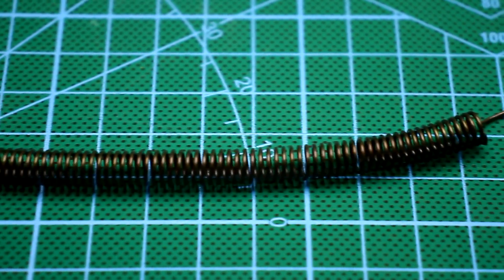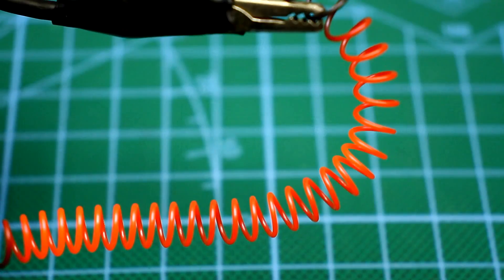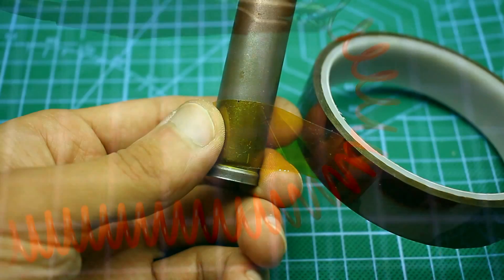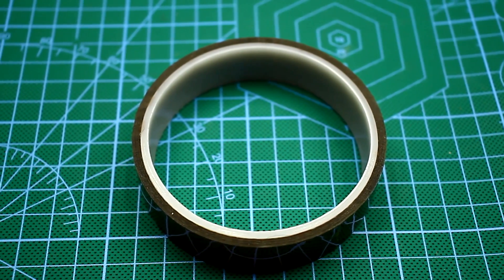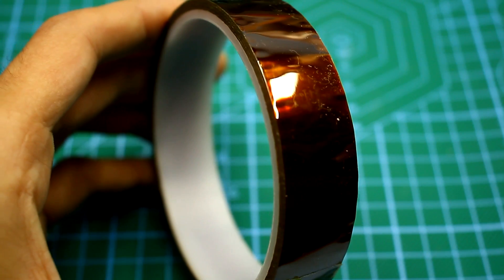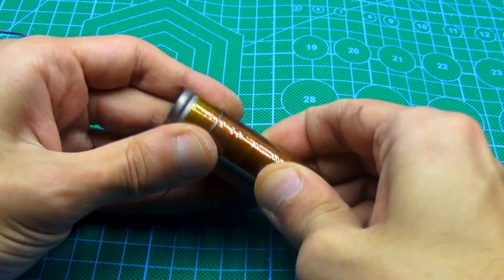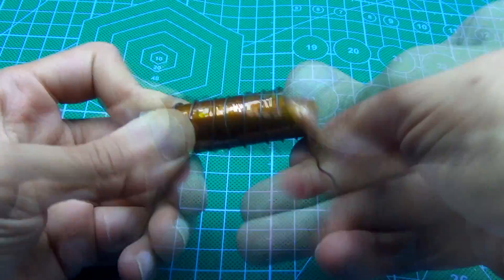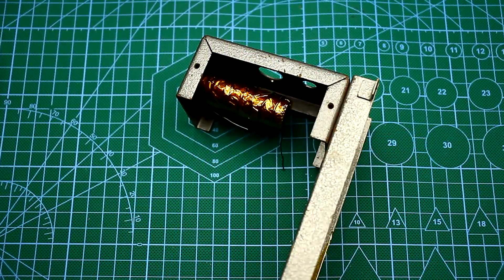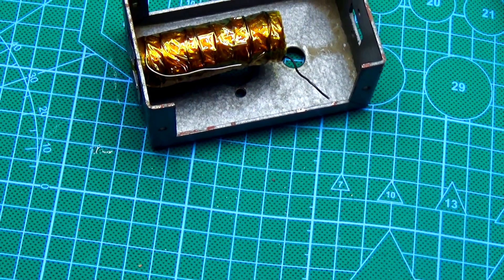The heater spiral is nichrome, bought at the nearest store. The wire diameter is 0.75 mm and the heater is heated to red. Next, on the metal case we wind the insulator — it is better to use fiberglass, but I only had heat-resistant adhesive tape, which I am sure will withstand temperatures up to 350 degrees Celsius and more. Wind two layers of insulation on the case, then reel up the pre-straightened heater wire carefully, keeping some distance between wires to prevent a short circuit. Over the winding, put insulation again — this time the number of layers can be increased. The bath is basically ready.